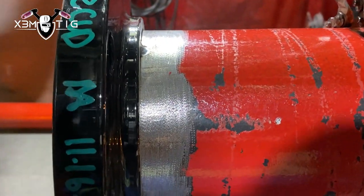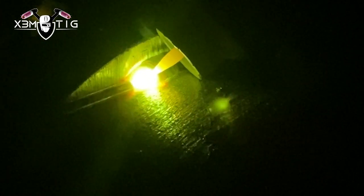From the outside I'm going to do two passes as well. For the first pass I can go with a little bit higher amperage — 160 amps. Usually those lines and those slip-on flanges are covered with paint, so good habit: try to clean it really nice. I cleaned the pipe and the edge for the fillet weld, but I didn't do a proper cleanup on the top of the flange so that paint is burning. It's a good habit to wear a respirator. Just make a nice good first pass.